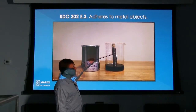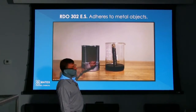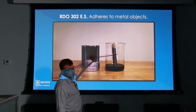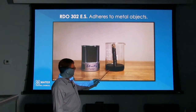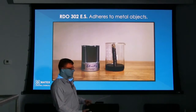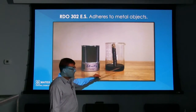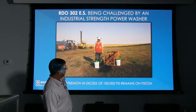What this oil will do to this rust eventually is peel all that rust off, especially if there's any water going by it — such as if you're injecting it down into your hammer and the rust was on the inside of your hammer. It would eventually peel all that rust off. So also if you had a hammer or an old tricone that was seized up, throw that oil in there over the weekend and there's a pretty good chance it will loosen up for you.